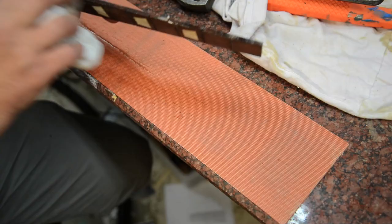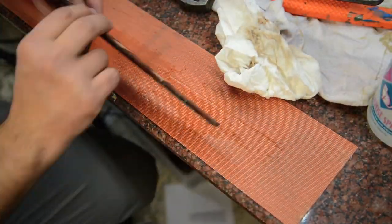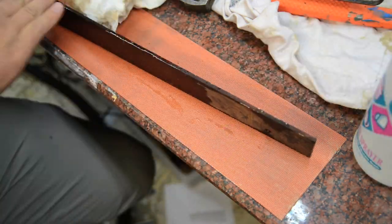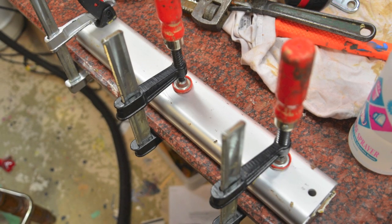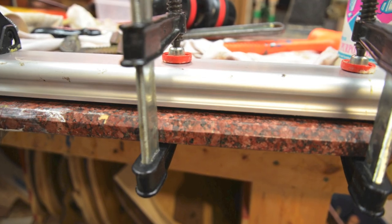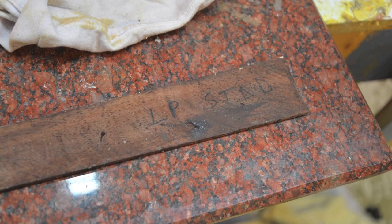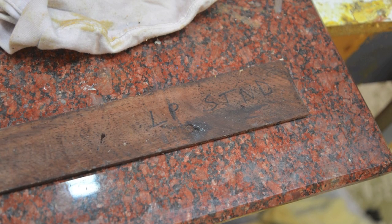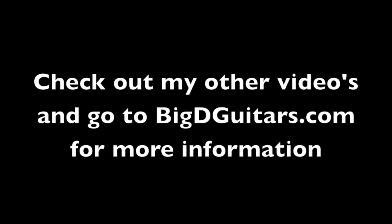There's lots of mess on the edge here — I'm just going to use a little bit of heat and water to clean it up. Next, we're going to clamp the fretboard down to make sure it stays straight and there's no bowing in it. What's nice here is you can see it says 'Les Paul Standard' and 'Brazilian Rosewood board,' which confirms it's a Gibson. Next up, we're going to strip all the lacquer off and clean it up.